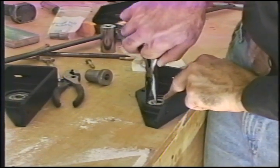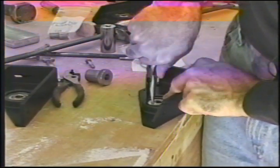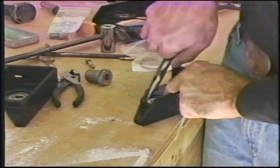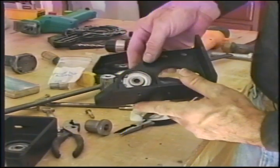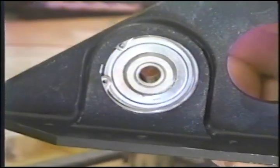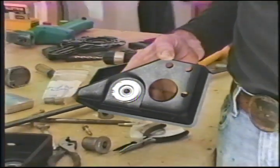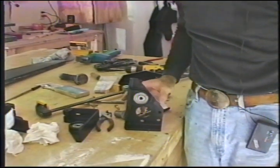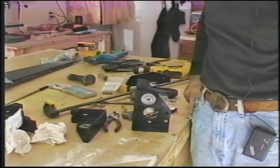Got one half of it in. It wouldn't hurt to file these, but I don't own them. There we go. Bingo. Dropped in place, snug. Finish them all that way, and then we're going to bolt all this pre-sanded stuff together and drop a gear leg in place. Finish cutting out the side of the holes in the fuselage. And then we'll show you where the appropriate sanding inside the fuselage must occur to mate these in place.